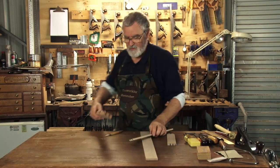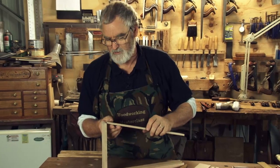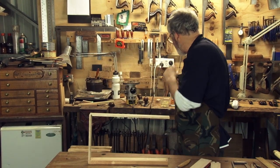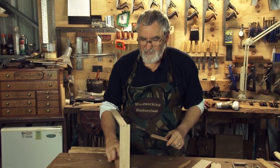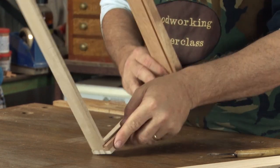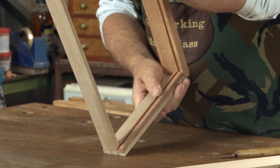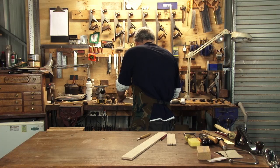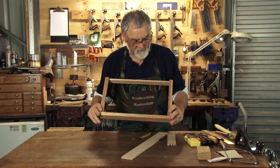So then they just get cut and married the same way as a normal dovetail and pin setup - it gets put together. And you'll end up with a drawer with the lap dovetail in the front and through dovetails in the back. The other thing we have to do, because we've already pre-run the drawer slips, is cut out a little bit so it'll actually fit up under the back rail. So the top of your slip lines up with the back of the drawer, and have it nice and flush with the bottom of the drawer side. That done, you'll end up with a drawer that looks very similar to that.